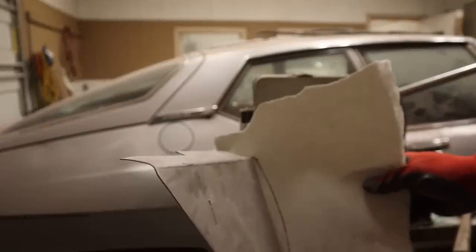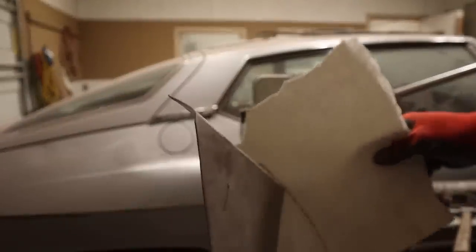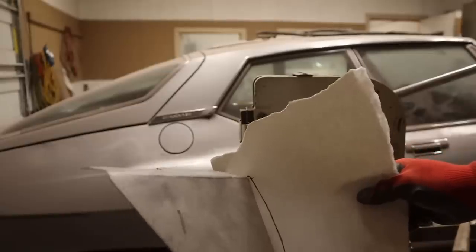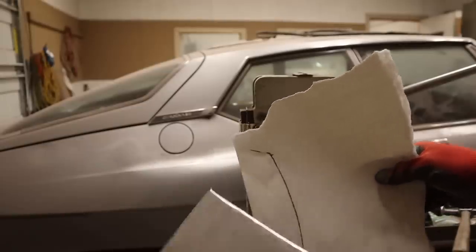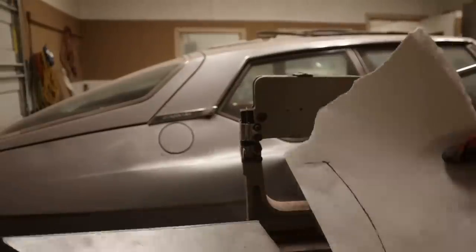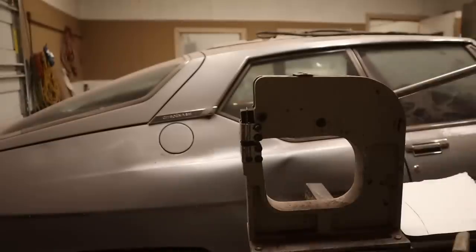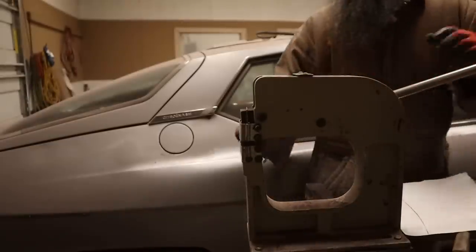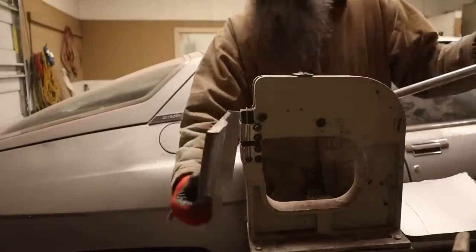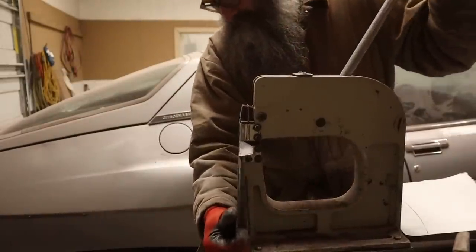Here's what we're trying to achieve - can you see that? So this is just traced from the old fender while Miles is working on it. I'm just gonna put this in the shrinker and pull it till it matches that, and we'll curve the rest of the piece by hand and we're done in a couple of minutes. You thought you got the gravy job - starting to look like maybe not.